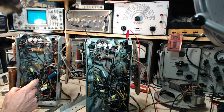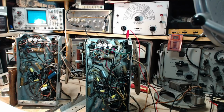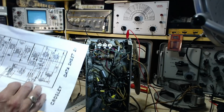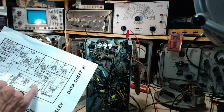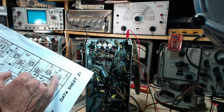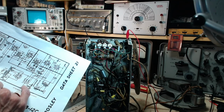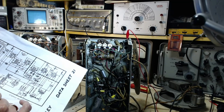Oh, wow, okay, so who's that guy? That's the grid. 0.04, oh! 0.04 on the grid going to the tone control. 0.01. There's a 0.004. Yeah, 0.004 here, top of the tone over to the grid here. So the tone control kind of bleeds down the treble out of the signal just as you're heading to the grid of the output tube.